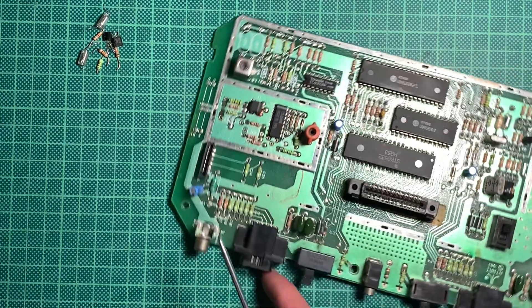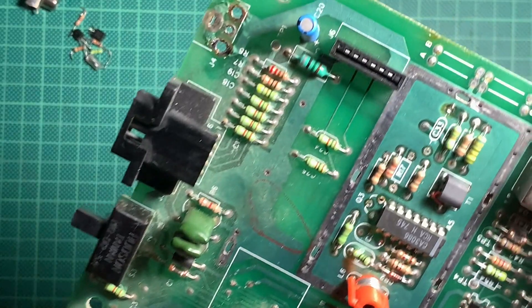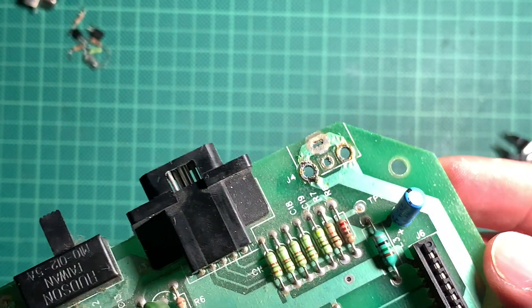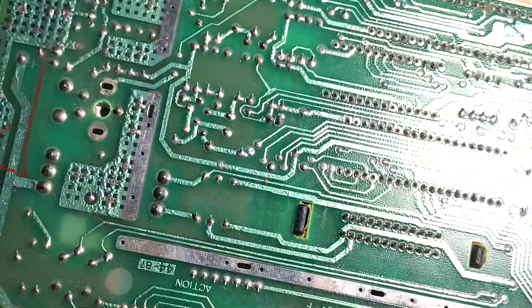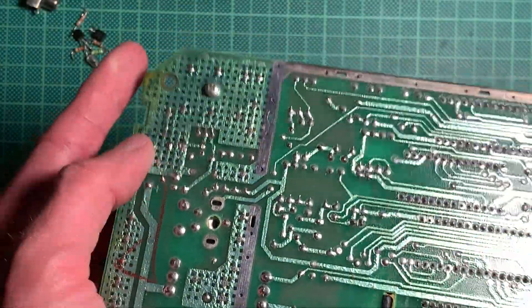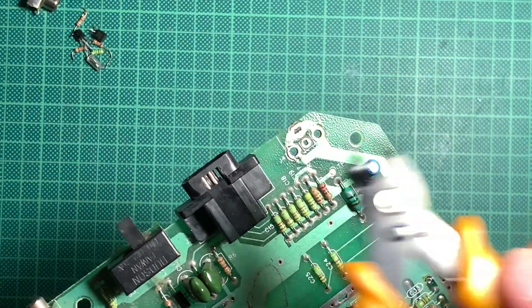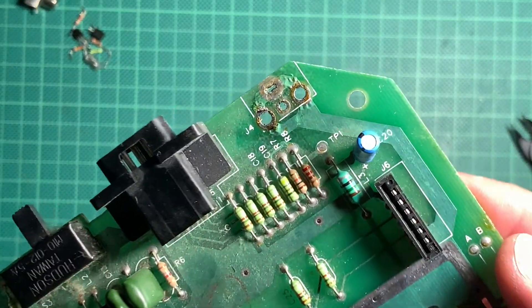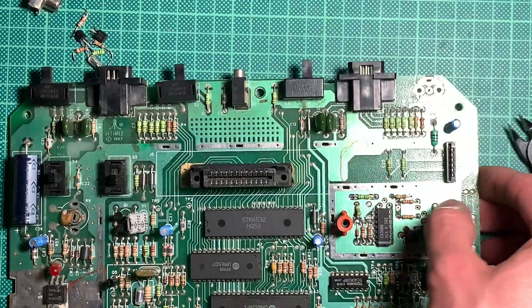Only thing that's missing is the RCA jack here. We'll do that pretty quickly and then we can install the mod. So the RCA jack is gone too. The part looks slightly corroded and the traces are a bit bumpy, but that's the case for many of the Atari PCBs. I actually used the snips to cut this off and then desolder the remaining pins, because RCA jacks are not really worth preserving — you can replace them easily.